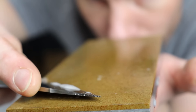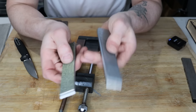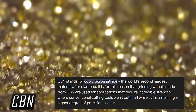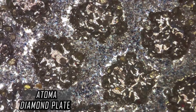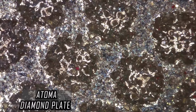Now there is another stone that's similar to resin-bonded diamonds, but bonded by metal — a metal-bonded CBN stone. CBN, or cubic boron nitride, is technically a little less hard than diamond, but it's very similar. As far as the grade of hardness, it would be one level down. However, for knife sharpening it has incredible wear resistance, and the edges tend to stay sharper and cut a little bit faster.